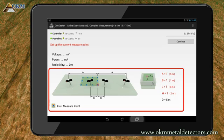There you find the positions and distances at which you have to place your equipment during a measurement. The power electrodes are represented by the letter A. Those electrodes must now be placed at the cable marker position 1. The voltage electrodes are represented by the letter B. Those electrodes must also be placed at cable marker position 1, but the voltage cable drums must be unrolled completely.